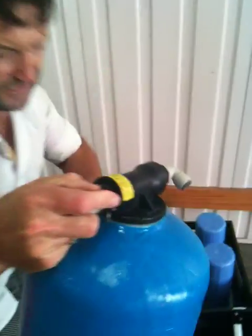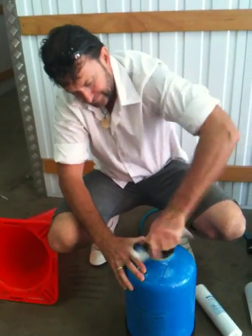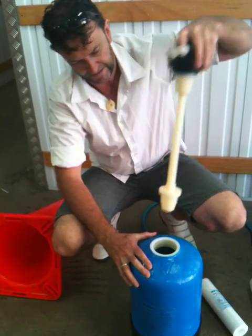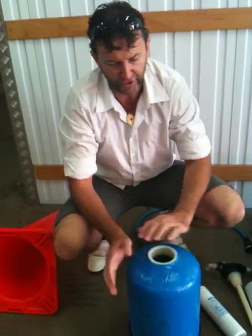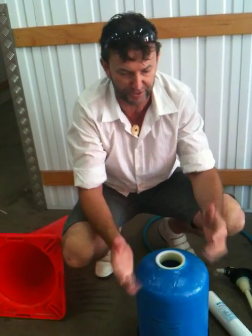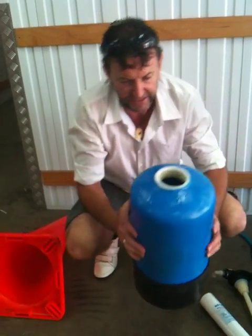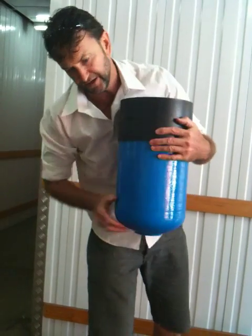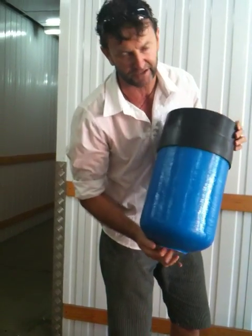Now I've got my resin tank. To fill a resin tank quickly, you just open that up and take that out. When you go to empty the resin, don't let the water come out first. Go somewhere — either a hessian bag or into your rubbish bin. This is completely inert, you're allowed to put it in your rubbish bin. Basically you want to grab it, turn it upside down, get a whirlpool going, and all the resin will come out. You won't have to hose it out after that at all.